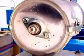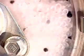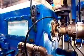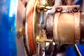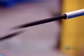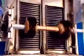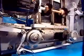This factory also uses polypropylene pellets to make straws. The black beads are pigments to color the plastic. An extruder, a different one this time, melts the pellets, then forces the molten plastic through a circle-shaped die. As the long, continuous straw exits the extruder, it cools and hardens in a tank of chilled water. As it leaves the tank, a knife chops it into individual straws. They fall onto a conveyor belt, which transports them to the packaging line.